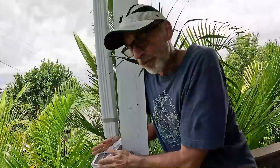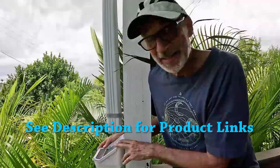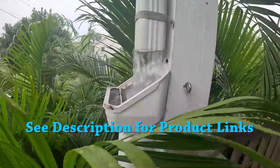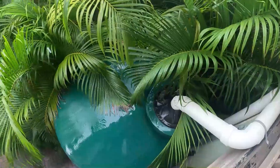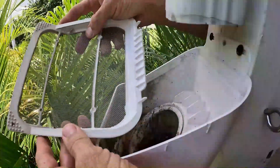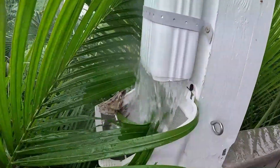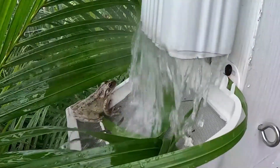The water, directly from our downspouts, first goes through what's called a leaf catcher. This is an ingenious device — pretty simple in design, but it prevents a lot of large-scale material that might blow in or be trapped on the roof from going into your rain tank. It's a screen at an angle, removable for cleaning, and then it just snaps right back in place. This is our first line of defense for keeping our water pure.